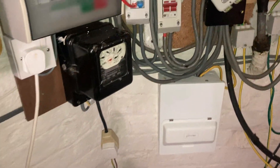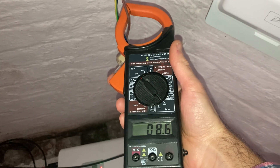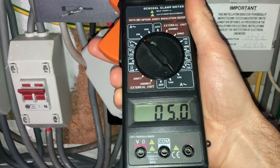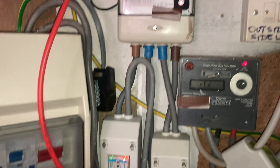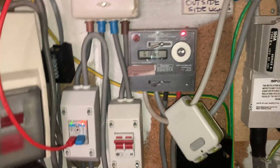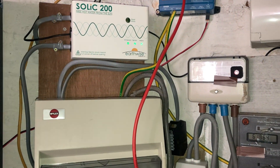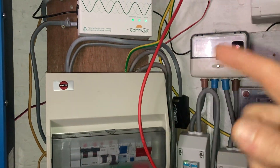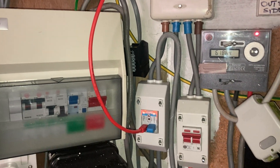I could have turned on a heater manually, but I wanted to check this. In the last video I used my clamp meter to check current — that's eight amps, which is about roughly two kilowatts, that's about right. But I also put it on here and I was getting four, and I'm getting five. That clearly is not right for whatever reason, because from all the red lights and also the display — which I can't show you as I'm filming on my phone — the display was showing two kilowatts being consumed, mostly by this, maybe 100 watts elsewhere, and two kilowatts being generated by the solar. So it seems to be matching.